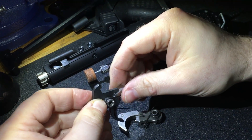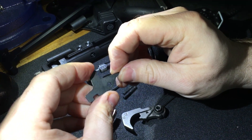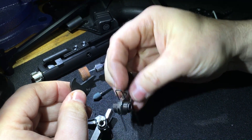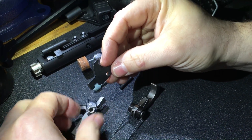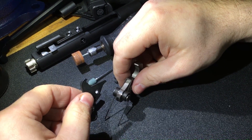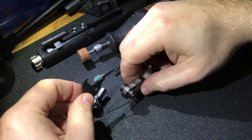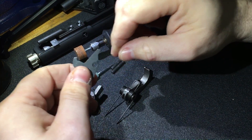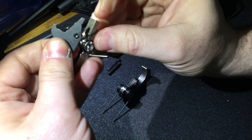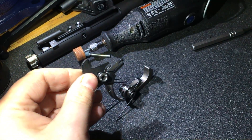I'm making this video because I can't find any of this info online. I have a feeling that when people's triggers malfunction they automatically assume their trigger is garbage and buy a replacement — and with the replacement it's fine because it's in spec. There's variance, so it's luck of the draw getting a malfunctioning trigger. Remember: file the tip off in order to bring the hook closer to the sear point, and that will make a positive reset.